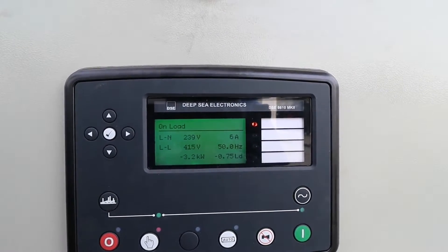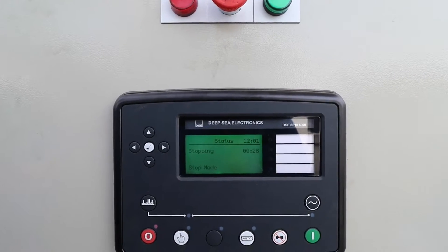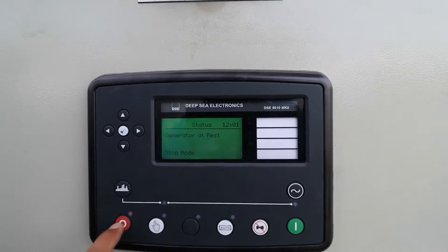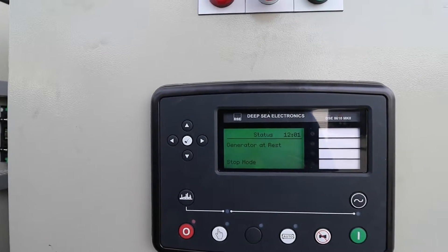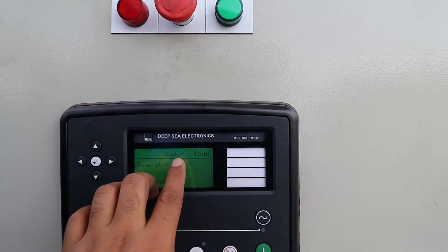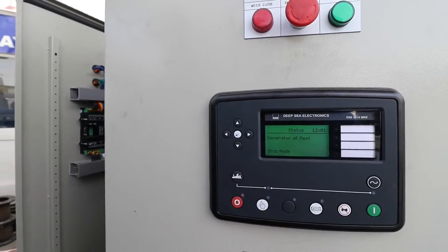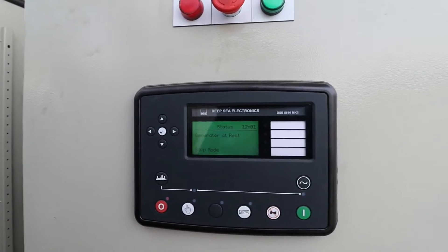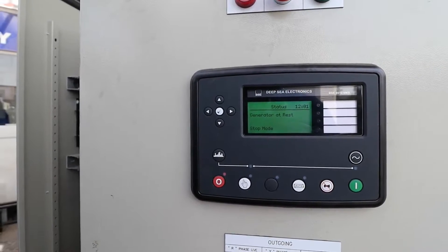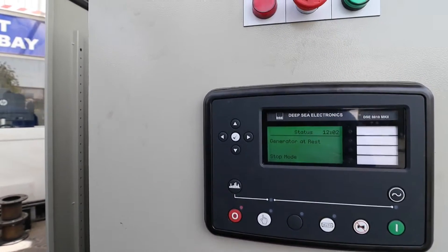It is closed and it is synced. No, stop, stop! As you can see, our circulating current started from 5 and increased to 12, 20, and rising. I stopped it before it got worse. The problem is the circulating current - if I had not stopped it, one generator would have become overloaded. To avoid that I stopped it already before it happened. Let's troubleshoot why we are having that circulating current.